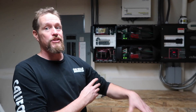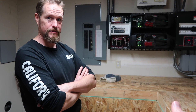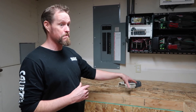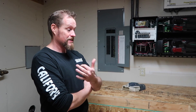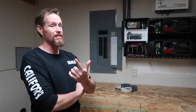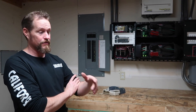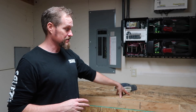With the Edison batteries you just have to add more water — it doesn't really harm the longevity of the battery bank. Whereas with lead acid batteries they're a bit more temperamental. The Edison batteries are also beneficial in that you can draw their charge down much lower. With lead acid you don't really want to go below 50%, and 80% is more recommended, whereas the Edisons you can draw really low — set them and forget them without worrying about keeping them topped off. That's one of the big things: those Edison batteries are super robust and take a ton of abuse.